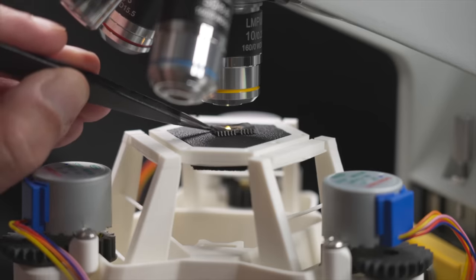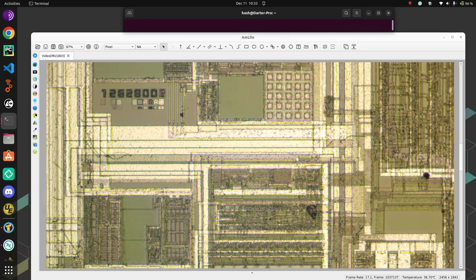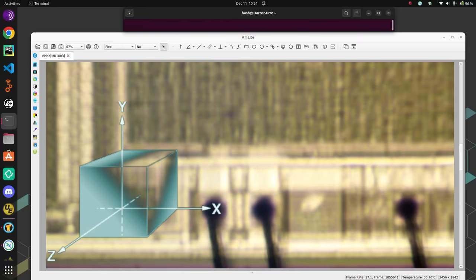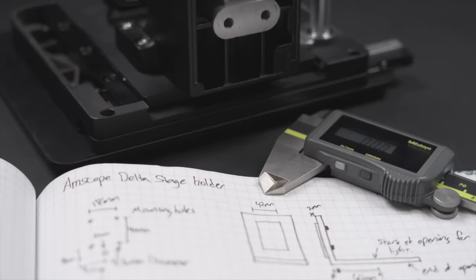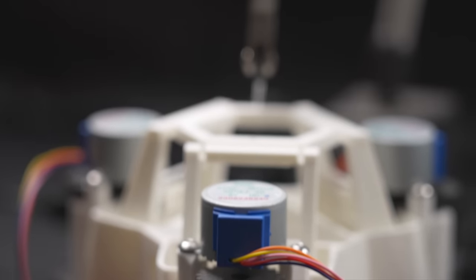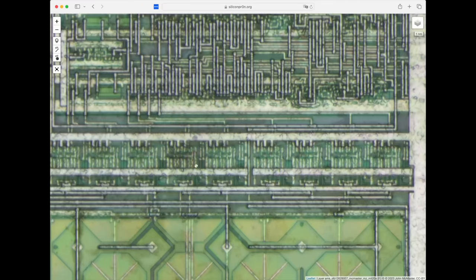Now let's put this microchip on there, move it around, and see what we can find. At first, I'm just looking for any identifying marks that could help me determine who manufactured it — and ideally a part number. Information like this is generally placed on the silicon if you look around. By sending coordinates to the stage, I'm able to tell it where on the XY plane I want it to move, then control the Z axis — which is up and down — to focus it. Reverse engineering is about digging to see what you find, and then using those clues to inform where you dig next. It's rare that I find a smoking gun, but with enough clues and detective work, it's possible to find out a lot about a device the manufacturer might want to keep secret. If you want to check out more silicon images, visit John McMaster's site for some very detailed high-resolution views of microchips.